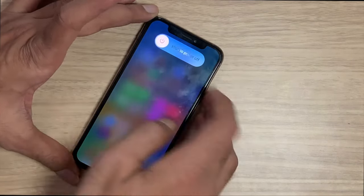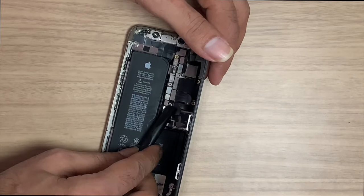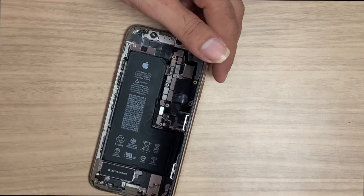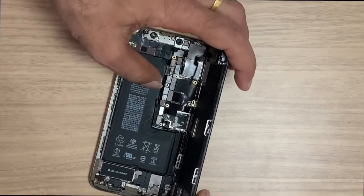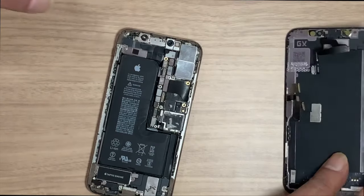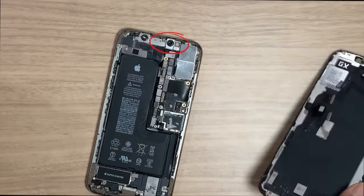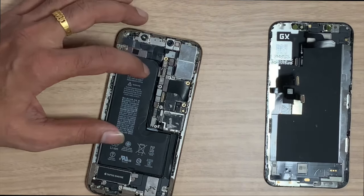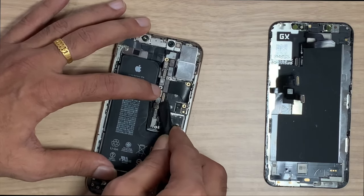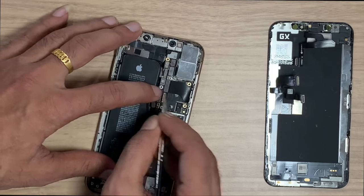This is a hardware related issue, so you have to disassemble your iPhone. Disconnect the battery and disconnect the flex carefully. Don't touch this red marked section while the battery is connected, because dot projector damage makes Face ID fail. So, these are circuit related faults. Disconnect all flex carefully and don't force or tear the flex.